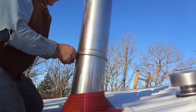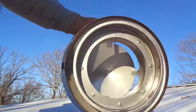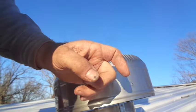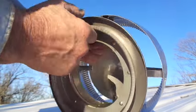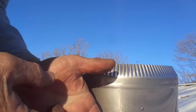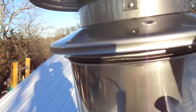Time for this neat little fella here — it's a draw band to ensure that these joints don't come disconnected. Just have to make sure you catch the lip on both pieces of pipe, tighten her down good and snug and she'll be there. Now this is a Belmont cap — it's actually a chimney cap. It does not have spark arresters. I have an extreme dislike for these things because my finger's got all the joints in it — this finger here does not. In 1986, I was installing one of these Belmont caps; I stuck my hand up inside to rotate it and twist it on, and that extremely sharp stainless steel edge severed my tendon in that finger. I lost the use of that joint — that was in the fall of 1986. That tendon drew all the way up down into the palm of my hand; I had a knot in the palm of my hand for a long time. You can see the threads right here as well as the threads up here, and just like the sections went together, it slides down and then you rotate it until you feel the twist lock lock into place. I've got to set the camera down in order to do that because I don't want to do it one-handed — I don't want to lose a joint on another finger.